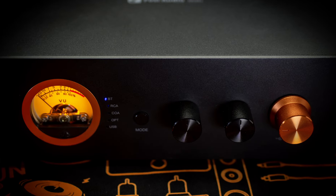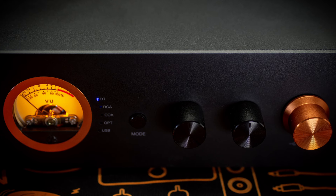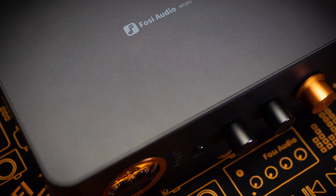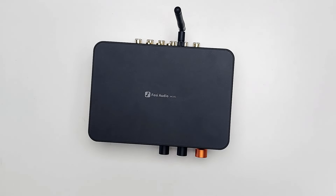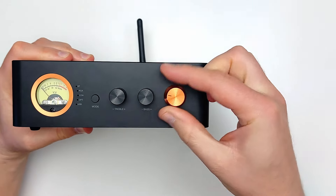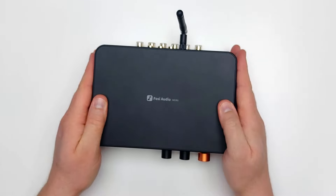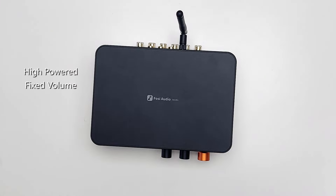What's worse is that the pre-out is once again mislabeled, as it does not behave like a pre-out with a fixed signal — it behaves like an auxiliary out. The whole point of a pre-out is to act as an uncontaminated pass-through for the pre-out signal from the source or DAC, be it analog or digital. The volume of the MC351 pre-out is completely determined by the volume control, and it barely reaches usable line level volumes until about 80%, at which point the loudspeakers would be causing permanent hearing damage. While the pre-out volume can be slightly higher from analog sources than the onboard USB input, it still remains quiet. Fosi Audio: future amps need to have a proper high-powered, fixed-volume, pass-through line level pre-out. As it is, this is unusable with a powered subwoofer and is mislabeled.